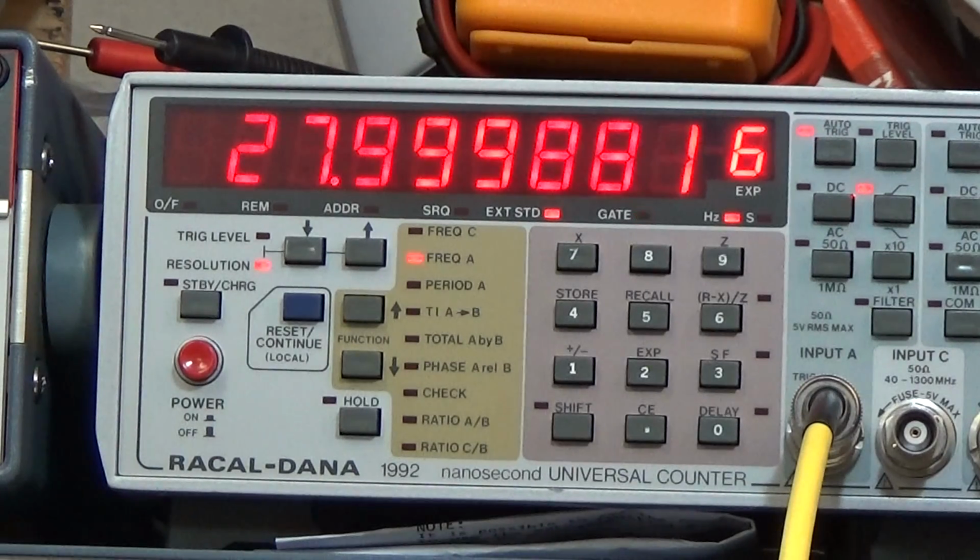Now I'm still transmitting with 127 watt, and I want to see if, with the amplifier output power, we have a change in our transmitter frequency. That would mean that the power amplifier temperature has an impact on our frequency. But as far as I see, there seems not to be a problem with our frequency, so there is no drift when I'm not talking.